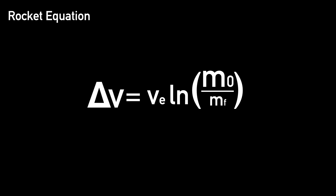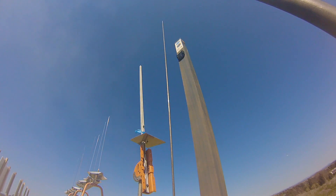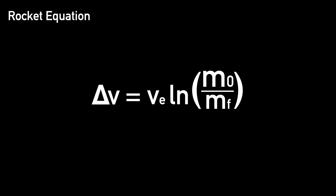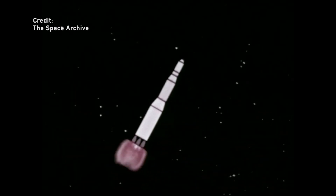This makes intuitive sense too, as we're lighting the second stage motor with all of this free extra velocity and altitude while shedding a considerable amount of mass. This also explains why it's not beneficial to simply light both motors on the launch pad for an initial higher thrust, since that creates the same increased wet mass but a significantly larger dry mass after burnout, meaning the mass fraction wouldn't be as large and so we would have less delta-v. Staging essentially allows rockets to have a much larger mass fraction than feasible with any single stage configuration, which is why it's so far been the only method to reach orbital velocity — or more accurately, a delta-v of approximately 10 kilometers per second for low Earth orbit.